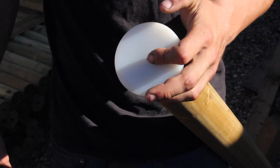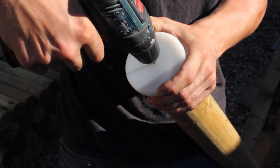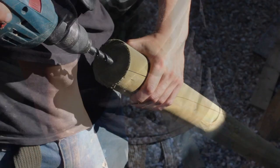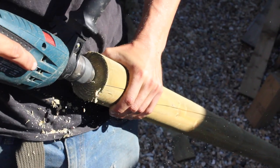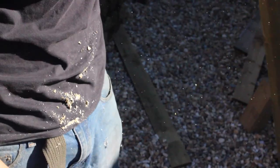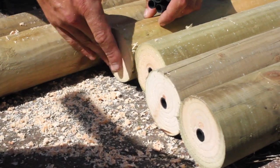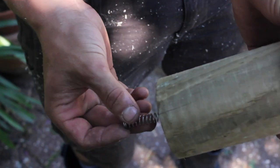Using the drilling jig, which can be purchased separately, drill a pilot hole to mark the centre of the pole. Next, using a 13mm auger bit, drill 60mm deep into the pole. This hole must be straight for the poles to rotate properly, and care should be taken whilst drilling through knots. The plastic tubes should now be placed into the hole, then the spring, and finally the axle. The poles are now ready to be placed into the brackets.